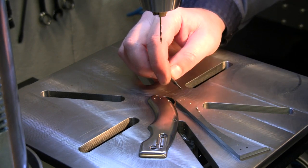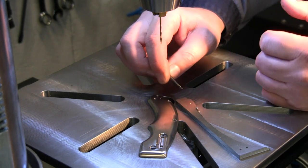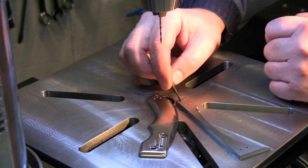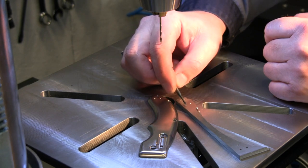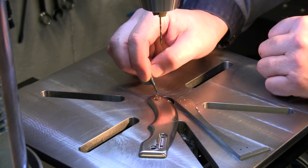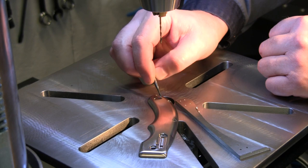I've backed the tension off again so that we're not fighting, not trying to solve two problems at once. So I'm going to have the tension backed off. We'll tap these two holes a little oversized, and then we'll see how that's cutting. We'll go in and see how well it taps with holes drilled with the number 50. If everything goes through fine, then I've got one hole left to tap on this piece.